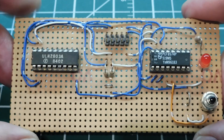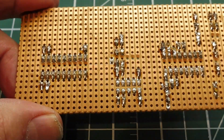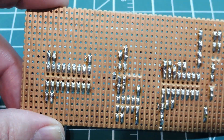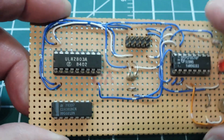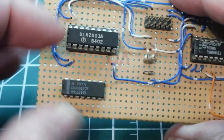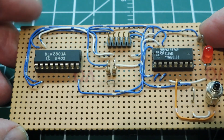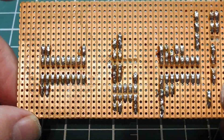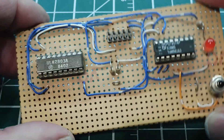Of all the techniques I've shown, this is my favorite one that I use the most — the vector board with the copper strips. I like this technique because I can make my own isolation channels. If I ever have to add anything to the board, say an IC right here, I can go underneath and just make an isolation channel across and wire up the circuitry for that chip. It's very versatile, and if you plan it right, you can get pretty compact circuits onto a small piece of board. So it's very efficient, and that's my favorite of all the techniques. I hope this video has given you guys some ideas on how you could do your own prototyping.